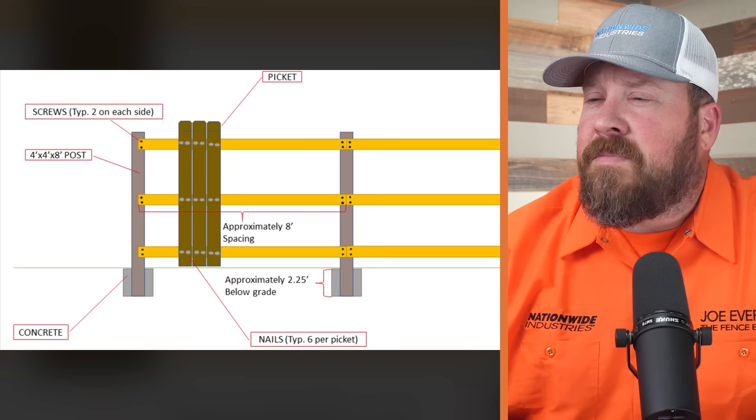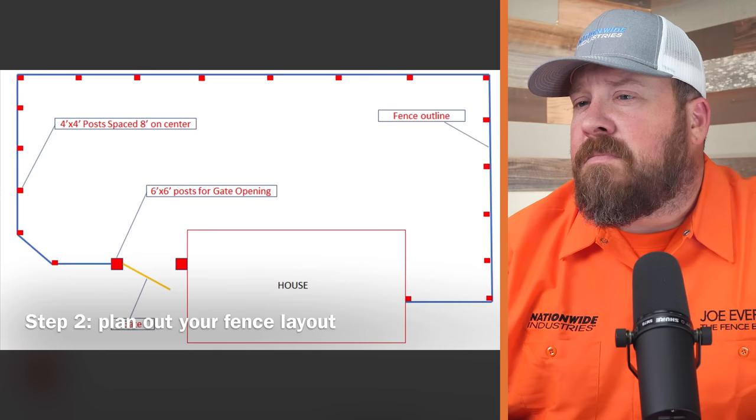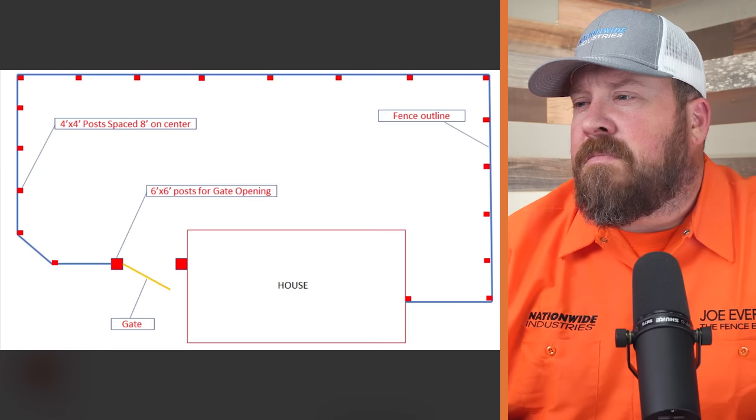Regardless, he's going the extra mile by installing two screws per each side of the 2x4 — that's correct. Two feet of concrete, then install your pickets one after the other with two nails going into each horizontal brace. He recommends installing the corner post first, then taking a string line to establish the perimeter, using spray paint to mark each post location eight feet on center. That way you won't need to cut any of your 2x4s.